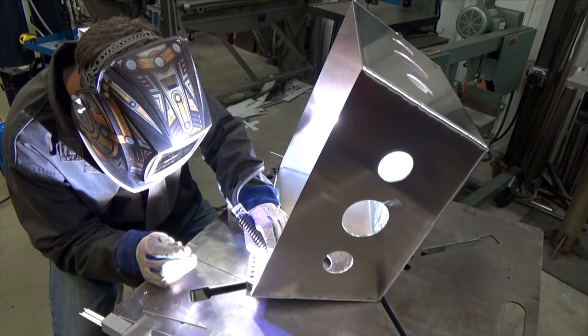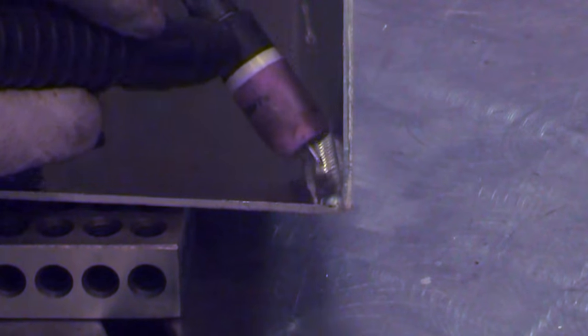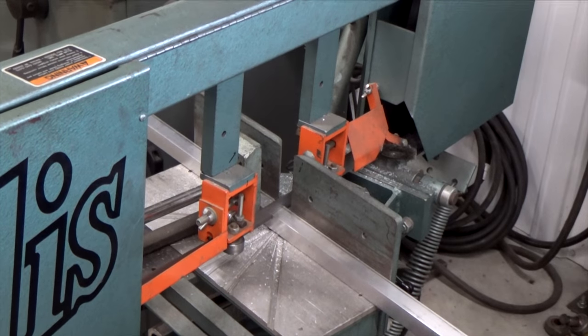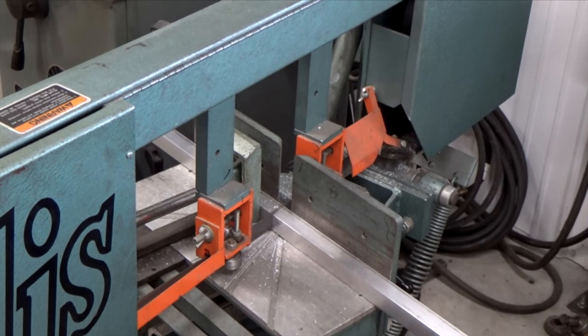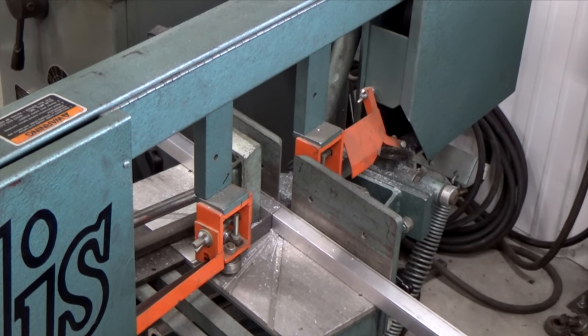Also put about a 2-inch weld on the bottom inside corners. Now cut and fit two pieces of the 1x1 square tube to fit underneath the top. If you have a miter band saw, set it for about 12 degrees — mine were 15-and-5/16 inches long. If you bent your sides like I did, you'll also have to round the bottom ends to fit inside the corner bend.